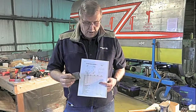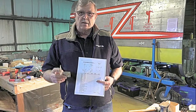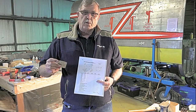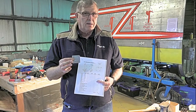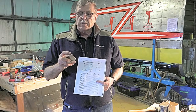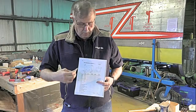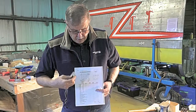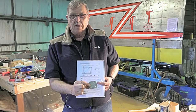So what we're doing here today is literally building ourselves a rivet gauge so that we understand the length of the rivet — when we put it into our piece of material, how long it has to be. After we've bucked that rivet, we're going to be able to measure the depth and the width of the head so we can determine the shop head size. We're going to build it to the dimensions on this piece of paper here — that's basically a finished one right there.